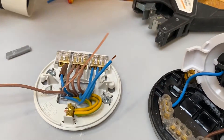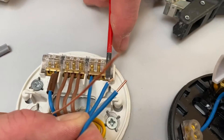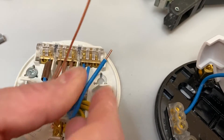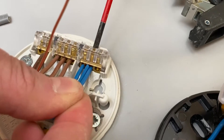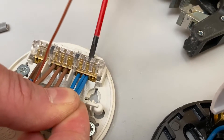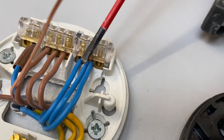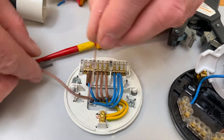It means I've got to go in the same termination. Sometimes it's worth just checking to see how crushed the neutral was the first time around — that it hasn't fractured and looks weak. If it looked really weak, I'd recommend you re-terminate because you're going to screw down into it again. Pop that one back in, put my neutral in with it, and just push them into position and tighten it up — so I've got two in the one hole. Just be careful the other person hasn't over-tightened them and fractured the copper, because now you've screwed back into them. That's picked up my neutral connection.